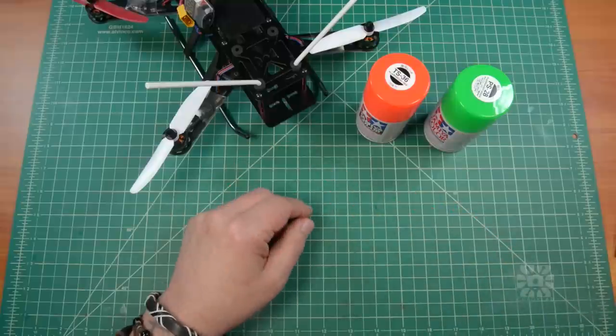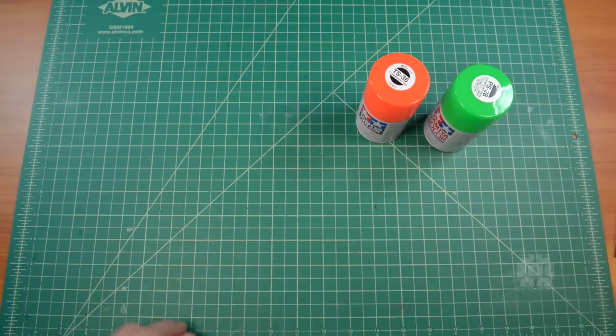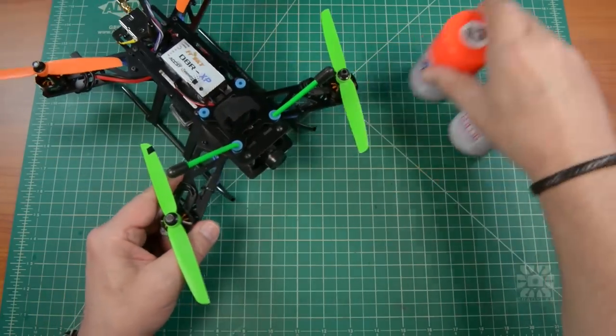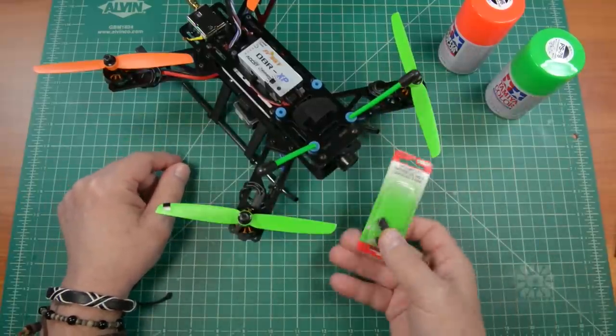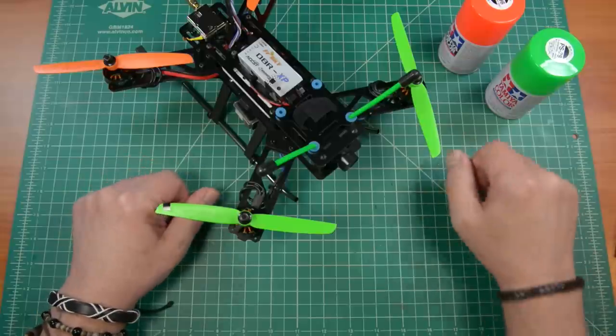Before painting, you'll need to prep the tubes with either a Scotch-Brite pad or 400 grit sandpaper, then finish by cleaning the tubes with alcohol. A nice finishing touch is adding plastic caps to the antenna tips, and the ones I use are 5/32 vacuum caps that you can pick up on eBay or any auto supply store.